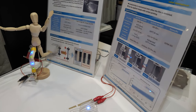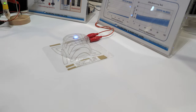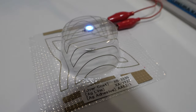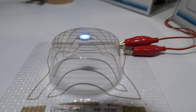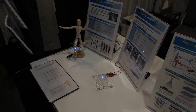So where does your electrically conductive paste go? What is this, for example? Well, this is our moldable material and this is printed on polycarbonate film and then thermoformed. This is just something we whipped up in our lab — a rough idea of what you can do with this material. We mounted an LED on the polycarbonate with the conductive film and an insulating overcoat.